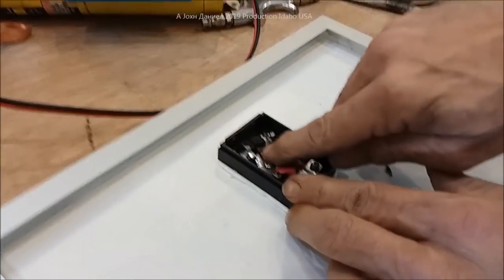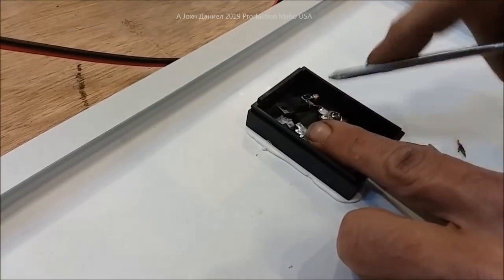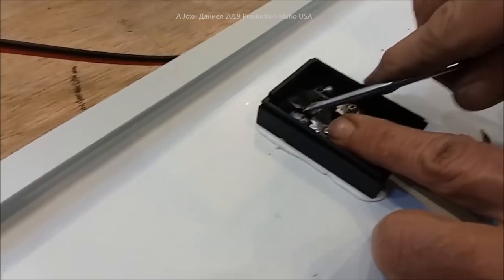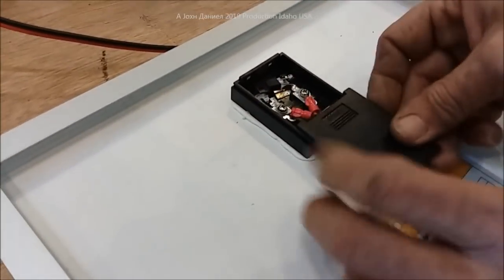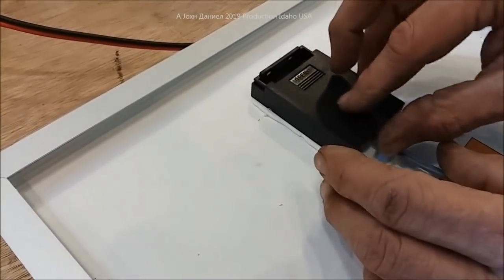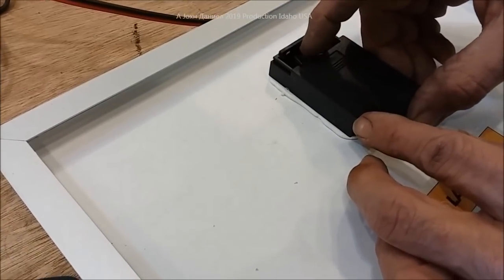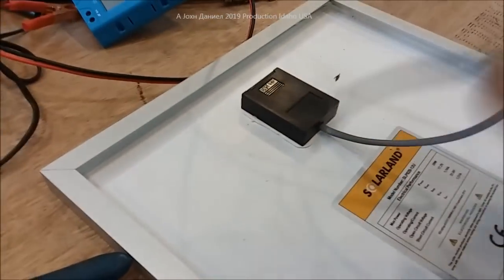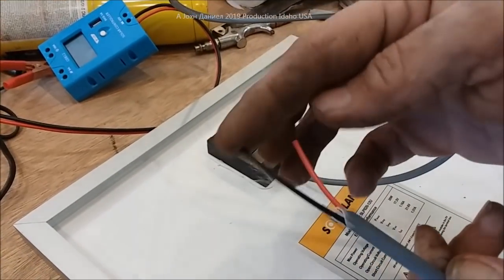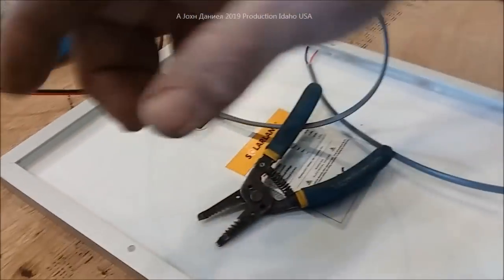Check to make sure your diode is not touching anywhere in the box, and you can very carefully push that bus wire down. Your diode should float fairly well, a little above your bus wire. Make sure the cover fits and snaps into place without resistance — move it back and forth to confirm it's not touching. If needed, pull up a little until it clears, then slide it down underneath and snap into place. Now we have our wire with leads separated so there's no chance of touching when turning the panel upright.